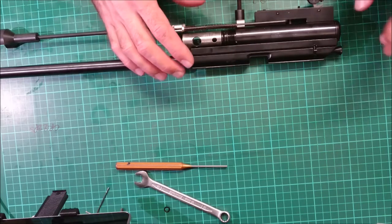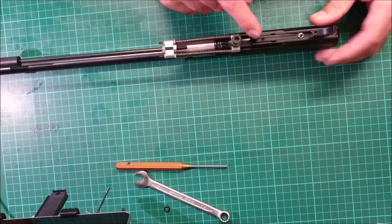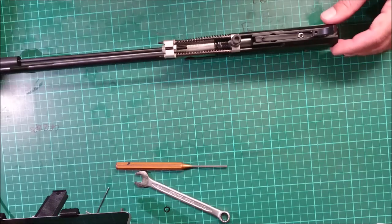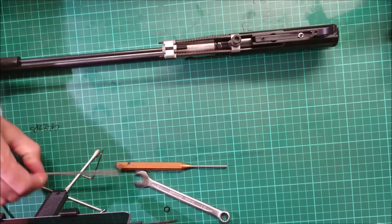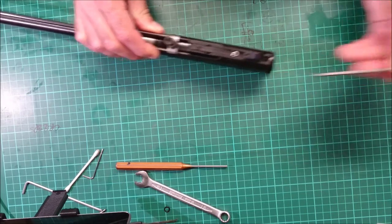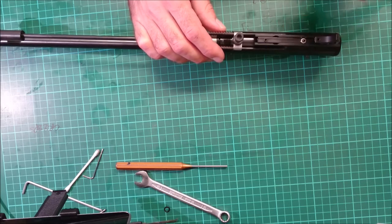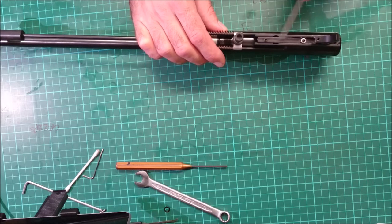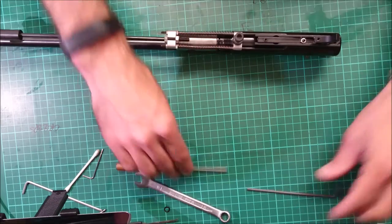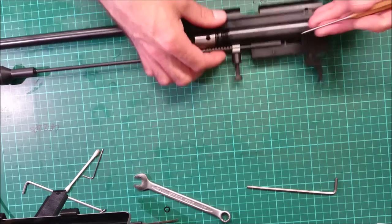I just wanted to show you — it'll be the same on some of the very early Ultras. In some of my videos you'll see that I normally tell you to undo the trigger mechanism. Normally the bolt's there, as it is on this one, and there's normally a bolt there. But on this one, you'll see you can't actually get to the bolt because there's a sear pin in the way. So I just wanted to show you how to strip these in case you have a very early one and my other instructions don't apply.